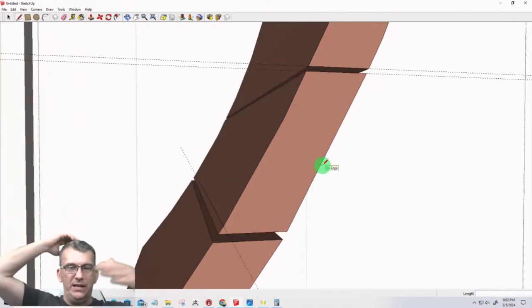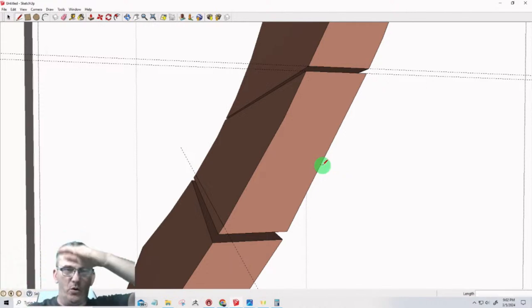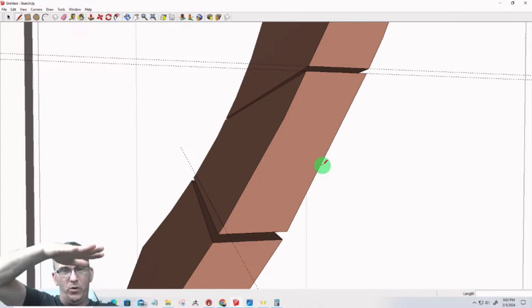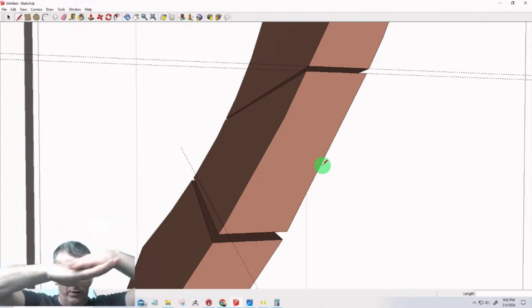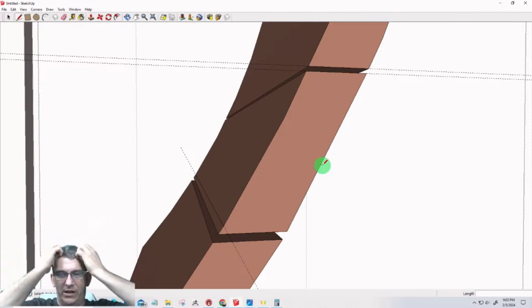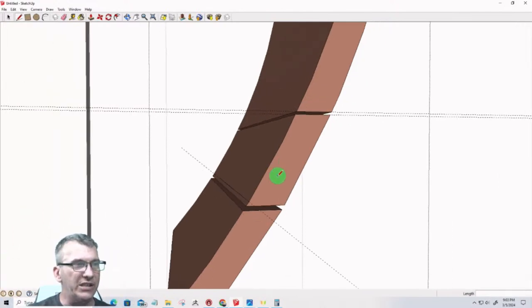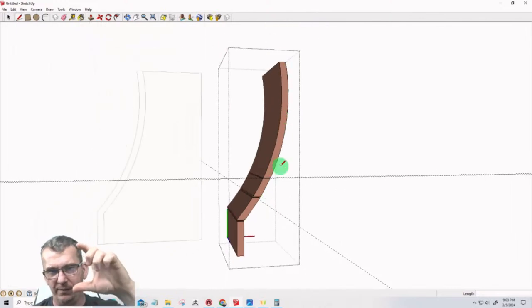And that's the curves that I have to determine what they are. I'll use a quarter inch ball nose, that board is going to be laying flat. The model cut will cut that curve and everything in the top. And then the two angle cuts will be cut at the table saw, right? And it's just going to be a matter of figuring out how tall the drawers are, what I want my drawer fronts to be, right?